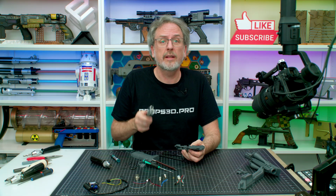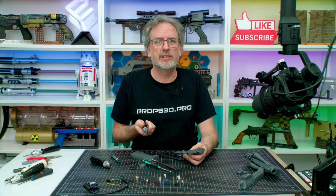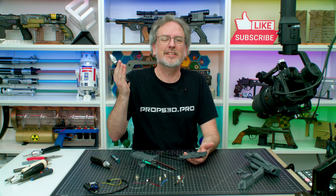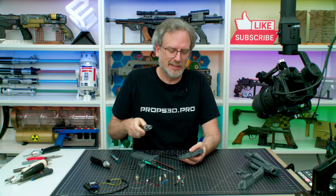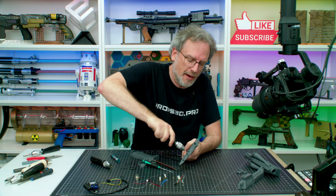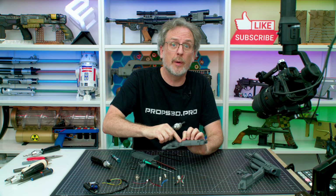And another thing I like to do with the 4mm is any hole that goes all the way through. In the 3D models, I undersize these slightly because if you have a different extrusion multiplier, etc., you might end up with a hole too big. Now, it's easy to make a smaller hole bigger, but the other way around is nigh impossible. So depending on your clearances, this will either be exactly the right size, or I recommend that you just go through.